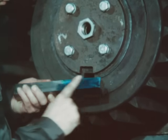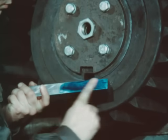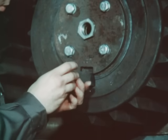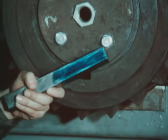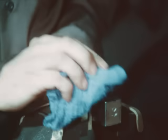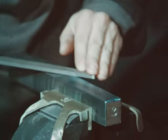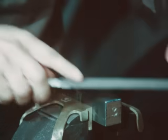The key is coated with Prussian blue prior to fitting in the keyway. Now insert into the keyway as far as possible. When the key is removed, any interference caused by high spots in the keyway will show as clear spots or marks in the Prussian blue. Note the high spots and remove the Prussian blue. If the Prussian blue is not removed, it will tend to choke up the file and require frequent cleaning.